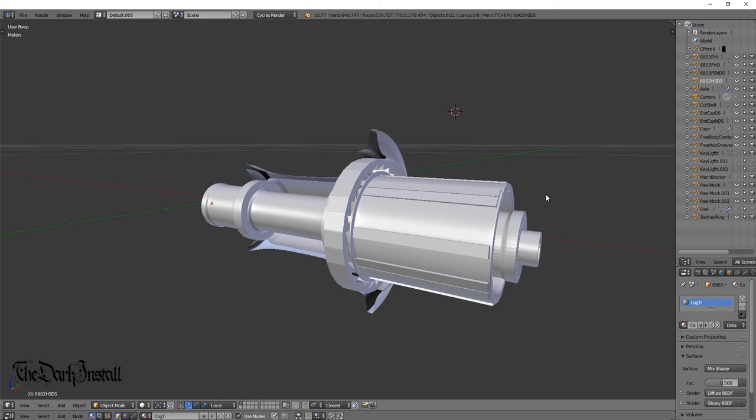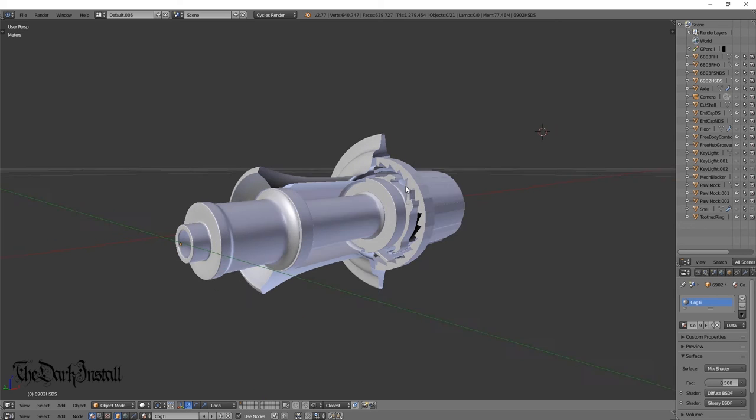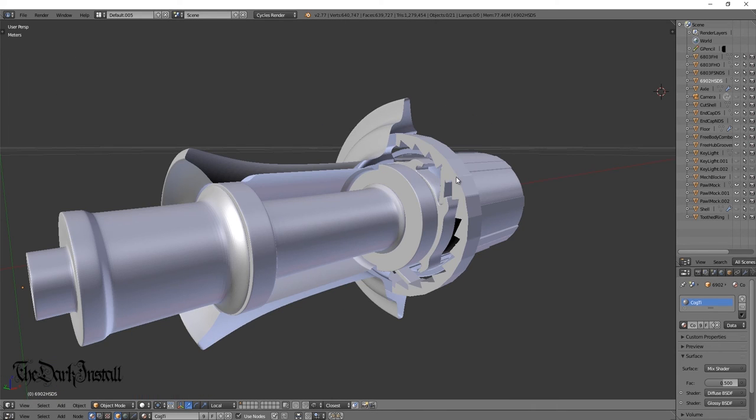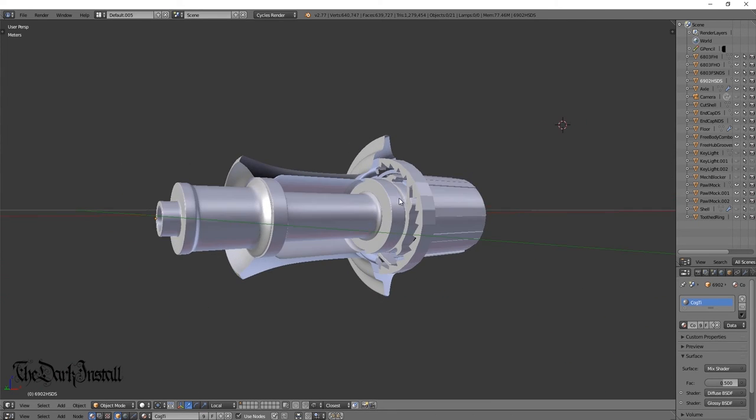I haven't modeled the driver yet — we'll do that in the next video. Here I want to introduce a new idea: I wanted to create a freebody ratchet system which could disengage when you're freewheeling so it doesn't make a ticking sound. Shimano have tried this recently and others have too. The reason is it reduces friction — with the current ratchet system the pawls ticking over the ratchet slows you down; if you remove that friction you're just rolling on the bearings, which is faster.